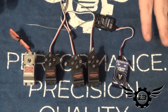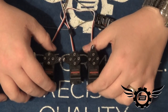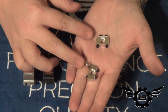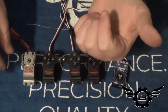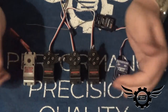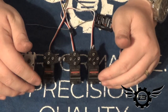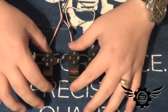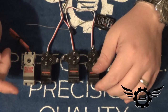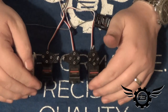The next steps in the manual are mounting the servos. You've got four of these little aluminum braces — two are used to mount the elevator servo and two for the rudder servo. The front two cyclic servos, aileron and pitch, bolt right to the motor block so those are pretty easy. A lot is going to happen in this next camera cut — I'm going to mount the servos, do preliminary wiring, solder up my speed controller and BEC. I'll show all that at the beginning of the next video.